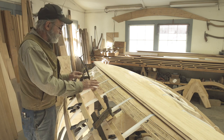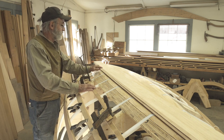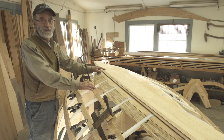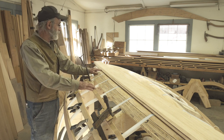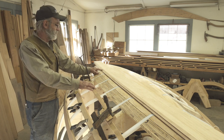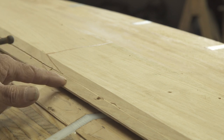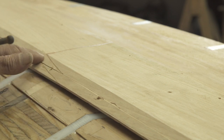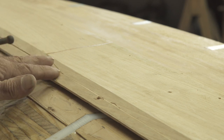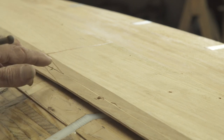There are some pretty interesting things about these planks. They're both scarfed together right here - one scarf right on top of the other, exactly the way everybody would say I'm not supposed to do it, but I have ultimate confidence in these scarfs that they'll never let loose. I cut these scarfs with an electric plane and cut them up awful close. I only had to touch them up lightly with a block plane before I glued them together with epoxy glue - they fit tight, they're never going to come apart.